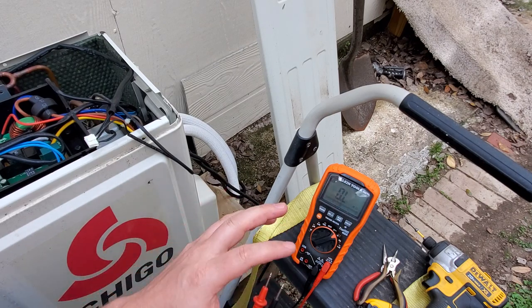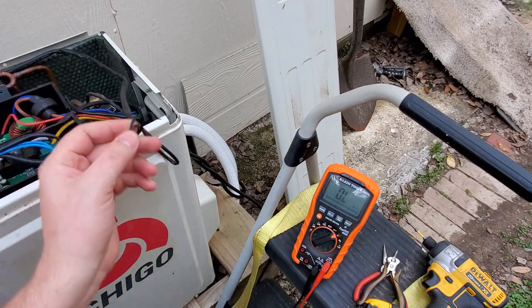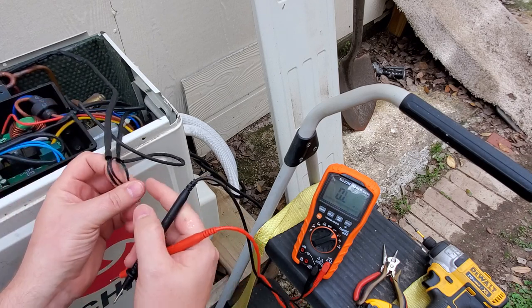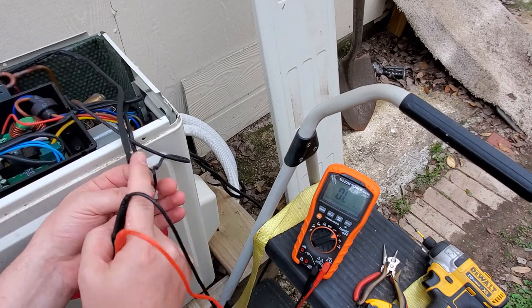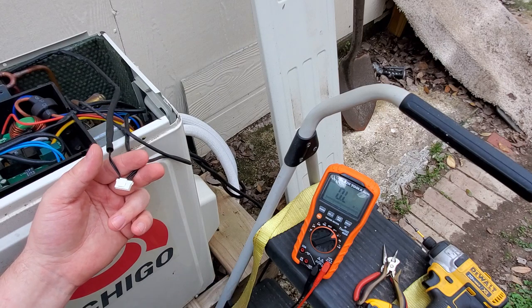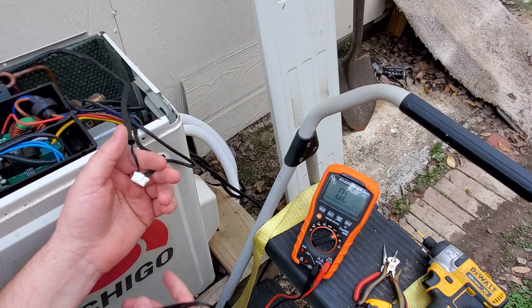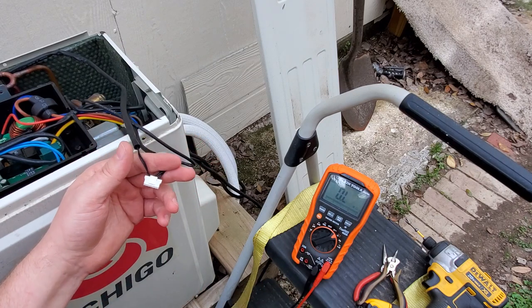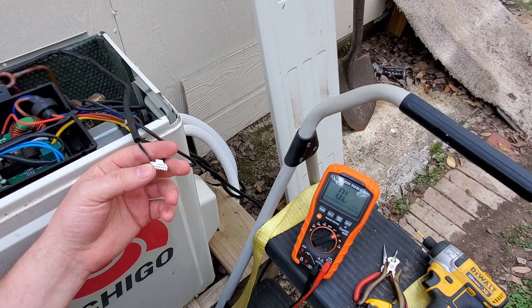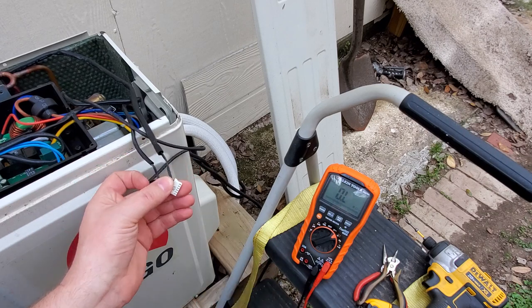In order to take an ohms measurement, there's a little bit of electrical current that goes from point to point — that's how it does a differential measurement and comes out to ohms. This is a really interesting situation because I've got two different types of temperature probes: one is my ambient air temperature probe and the other two are connected down to the tubing — that's my high side and low side pressure — so it measures the temperature on both of those. This is also a heat pump, so you have to measure both sides because there's a reversal of the coolant flow pattern.